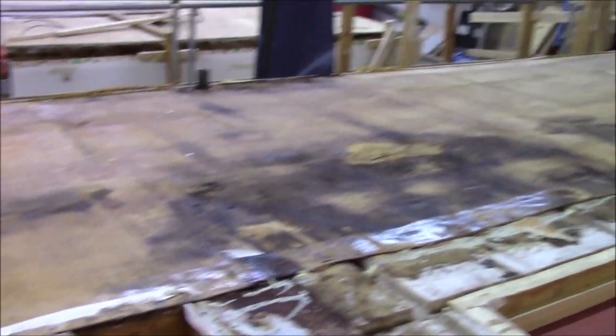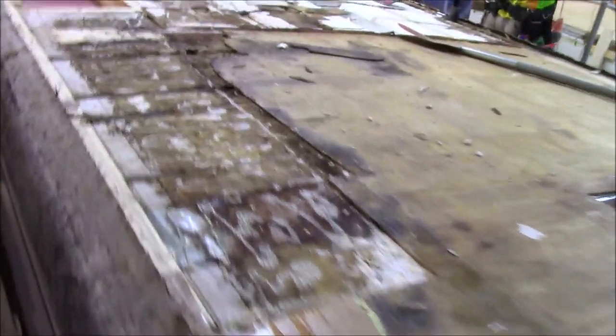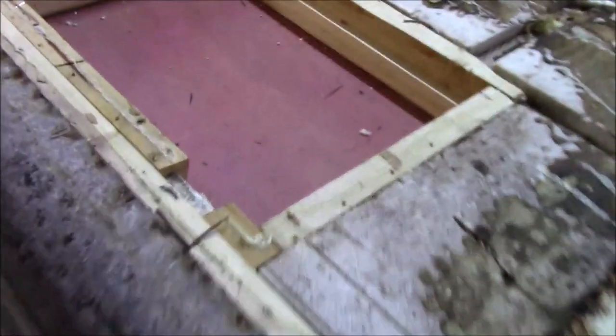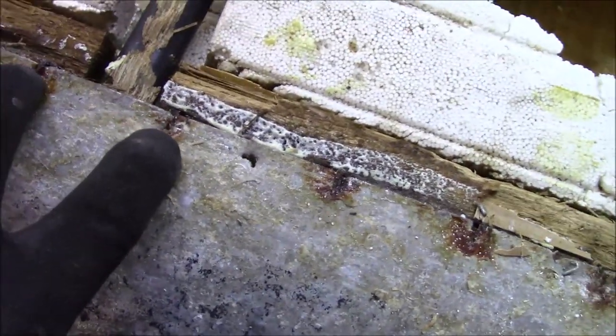We're going to spray it down with some mold kill — some of that is water staining, not necessarily mold, but I'm still going to soak it down. This area had some discoloration and had already started coming up, so we decided to pull this piece up and cut it all out, then re-deck it. The owner reframed this section but there are no screws in there, so we're going to fasten that back up. We've got rotted areas here and here. The big concern is these wires — nothing protecting them — just the shoulder. It looks like somebody was paying attention with the staples, but we're going to put a plate over that nonetheless.